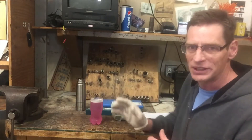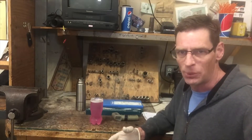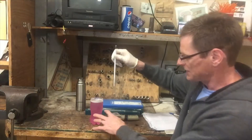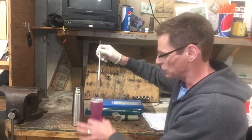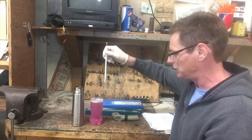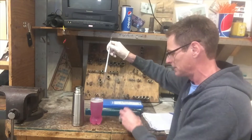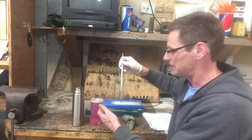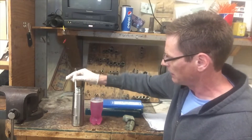Sorry for the one glove — I just don't want to touch this stuff. We want the freezing temperature of the brine to be at minus 6, and the density for that is 1.21. We measure that with this hydrometer right here, and this one's made for calcium chloride. This container isn't tall enough to use it, that's why I have this thermos I confiscated a while back. We've got to make sure the brine is at 60 degrees. When we pull it out of the system, I'm at 54 right now, so we've got to let it get up to 60. I'm going to dump this in the cylinder so the hydrometer can float and I'll be able to get a reading.